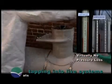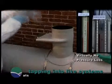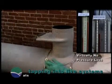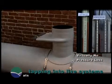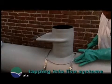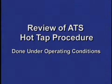As you pull your hand out of the tap, slide the blast gate closed to block the introduction of air into the operating system and disturbing the air balance. Remove the plastic from the end of the tap. With a squeegee, bevel the excess putty mix on the outside perimeter of the saddle flange to create a smooth seam. Continue with exterior bond as previously described.